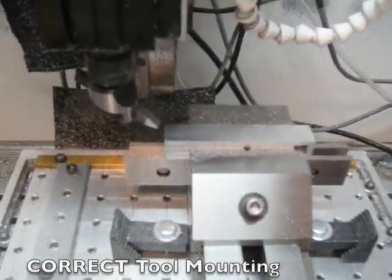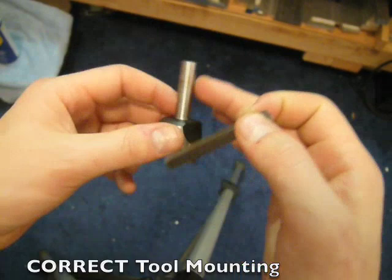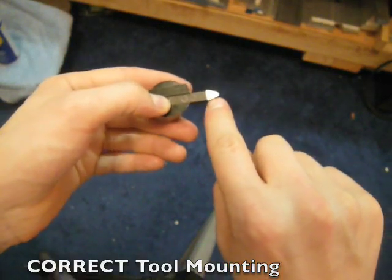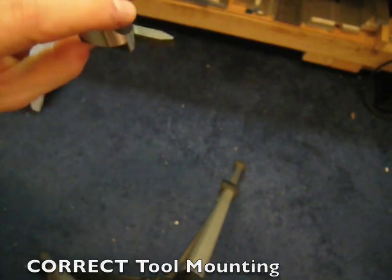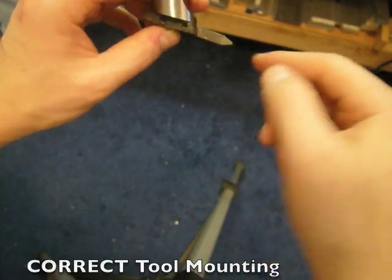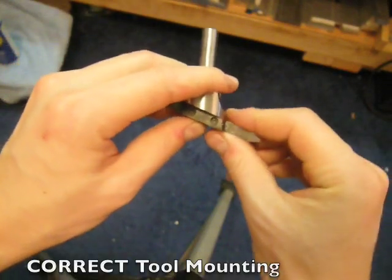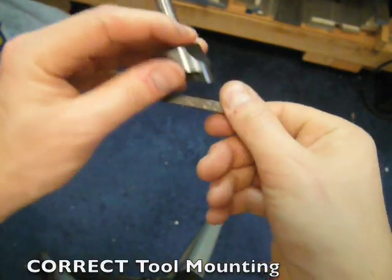Once again, just wanted to share, and I'm going to show you the tool bit. Here is the standard fly cutter that I purchased from Teg with a 3/8 inch shank, which I put in the 3/8 inch collet. When I was fly cutting last night, I was mounting the tool like this with the ground surface facing the bottom of the part — that was incorrect. What you just saw me milling was corrected: you mount the part like this so that when it turns, it's turning into the part. It just seemed like it didn't make sense that you'd be cutting all along this bottom edge, but that's definitely right, and it did a great job cutting. So the tool cutting bit is mounted like this, not like that.